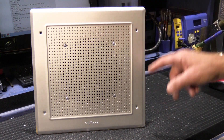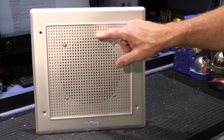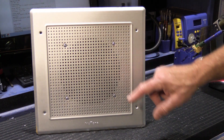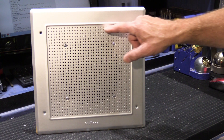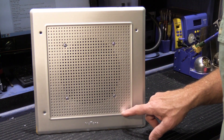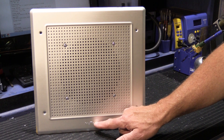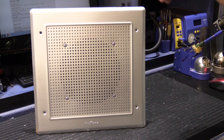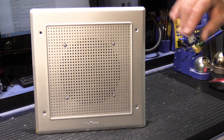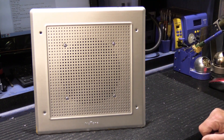What we have here is a 12.5-inch aluminum grill with perforations in the middle. The center circle where the perforations seem dark is the opening where the speaker cone is mounted behind. There is a blanking panel around the perimeter to block off extra holes so you don't get water in the wall. It always says NuTone on the bottom. The original styles from 1961 through about 1973 had a brushed finish, and starting around 1974 they used a silver anodized finish, which held up better.